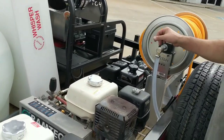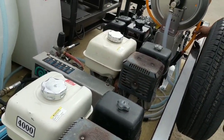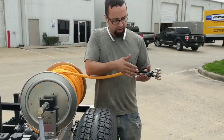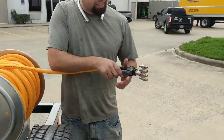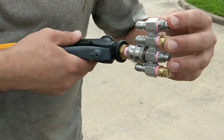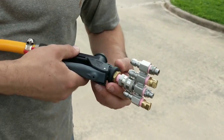Don't go over 200 feet on that hose, by the way — you will lose a significant amount of pressure when you do that. And then we have a pretty simple trigger gun that comes with this. It's complimentary with the machine — it's a Sutner ST510. It comes with a quarter-inch coupler, we have a bushing on the inside, and then we have what we call a J-rod, where you have your four different tips.